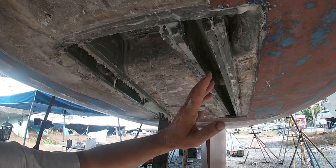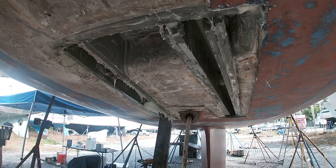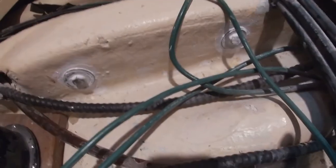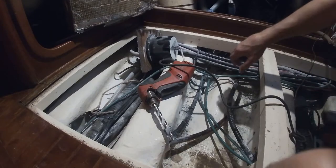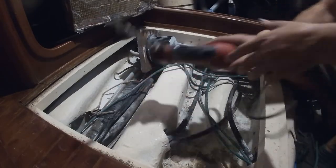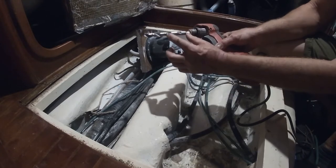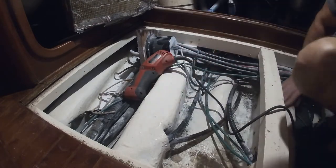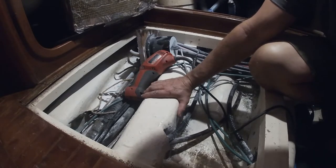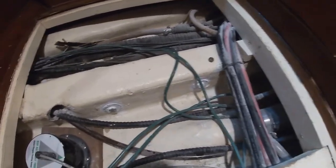Both beam structures are in — two on this side, two on this side. Now all I've got left is to drill some holes there, there, there, and there, put some bolts in there and a couple bolts back there, and the structure is done. To do this job you've got to have a certain type of drill — one that has a short throat — and maybe even smaller drill bits to get up in here, because right here are the beams we filled all that fiberglass into and made stronger. Finally all the bolts are in and I got all the grinding done.